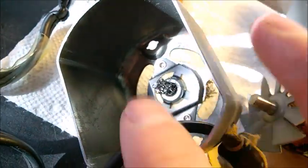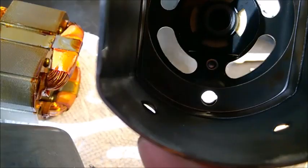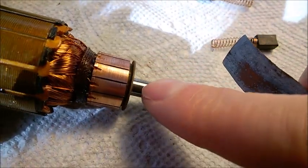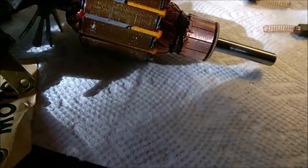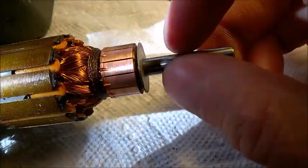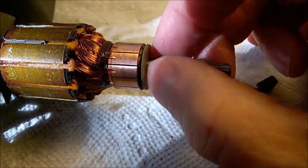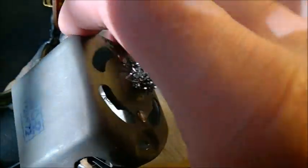A small note on the rod in the center: this motor has bushings — just a regular metal sleeve, no bearings. For these surfaces, do not — I repeat, do not — use sandpaper to clean inside the bushing, no matter how fine the grit. Always use steel wool for that surface. Cut a small piece and just rub it against the shaft in a circular, rotational movement — not translational — just around the area where the bushings are sitting, to remove old oil varnish.